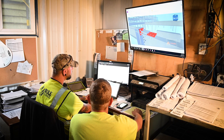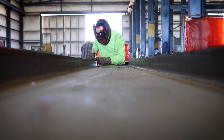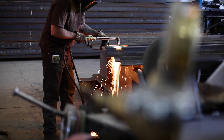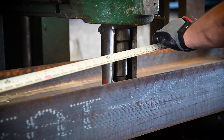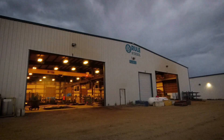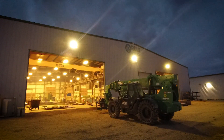I believe that it is a game changer. Using the yield link, it was easy to apply in the detailing model and easy to scrub the drawings because there's not a lot involved in it — holes and a cut — instead of an RBS system where you have all the special chisel point call-outs and rat holes. It saves detailing time, it saves fabrication time, and all of that adds up to quicker delivery to the job site.